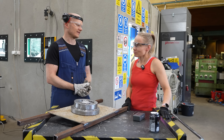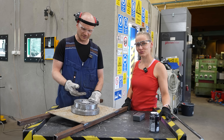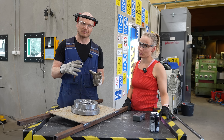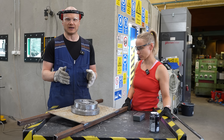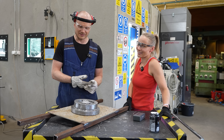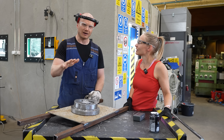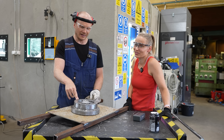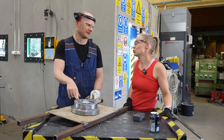You have to heat up aluminum almost 500 degrees Celsius — or this many freedom heat degrees — probably like as hot as five elephants or something. Elephant hot. And then you crush it out. You need like 800 bars, which is not that much for us. But the exciting part is the fact that when aluminum is at 500 degrees Celsius, it's only half as strong as it is now. So it might explode and send deadly hot shrapnel around — to our bunker, with deadly speed.